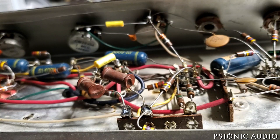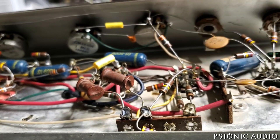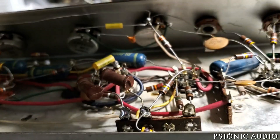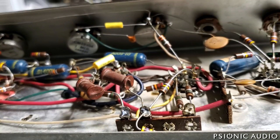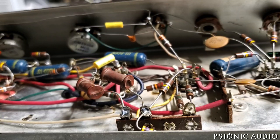I did not know what it should sound like in terms of hearing an example. I know what it should sound like according to the schematic, and this amp now sounds like that, aside from the change I made to the tone control and giving the amp overall more gain than it would have had in stock form with that bypassed cathode that I mentioned in the previous videos.